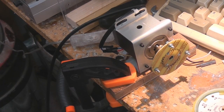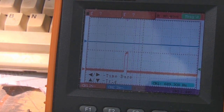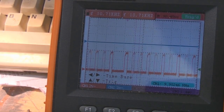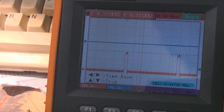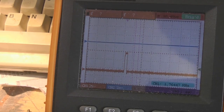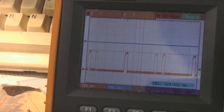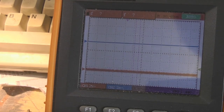I've actually had it working much faster than that. At the speed it would reliably go, winding 100 turns would take about 30 seconds, so I might just live with that. If we look at the step pulses coming out of Mach3, you can see why this is happening — the step pulses seem to be on a fairly fixed time-basis sampling, and as we approach the sample rate we're getting jitter. When that jitter happens we get steps that are too quick, causing the motor to miss steps. This is only the trial version of Mach3, which is locked to a 25kHz sample rate, so there's not a lot we can do. We need to either live with the slower step rate or find another solution.